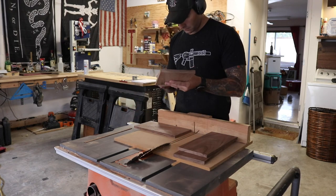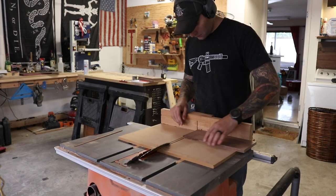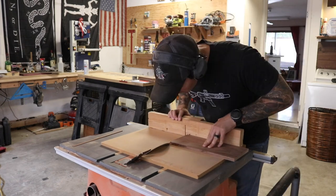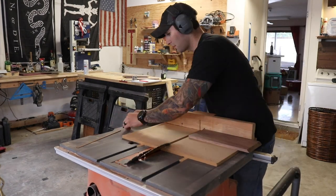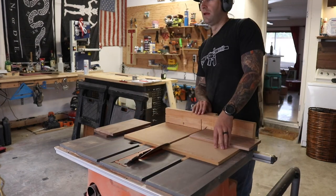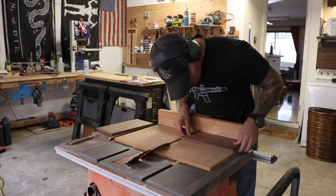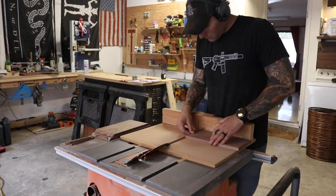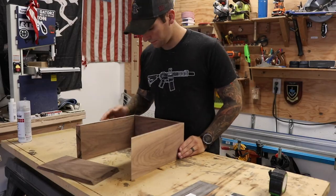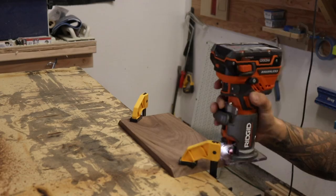Right here I'm just making sure that all the sides of the boxes are the same width, and now I'm going to put a 45-degree bevel on it because I want mitered edges instead of butt joints. The first mistake I made was using a crosscut sled — the piece being cut off was so small I had to turn off the blade and let it stop every time I wanted to make another cut. But once I got them all cut, the box fit fine.